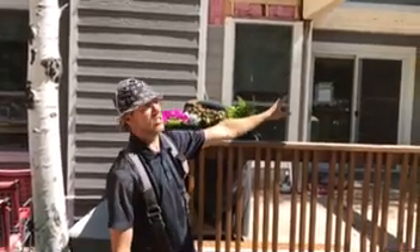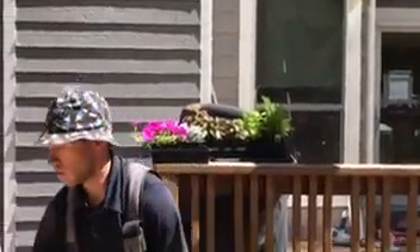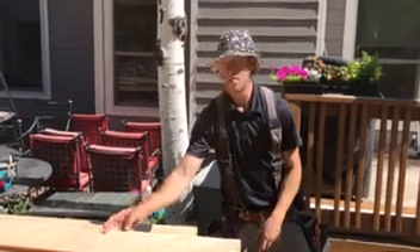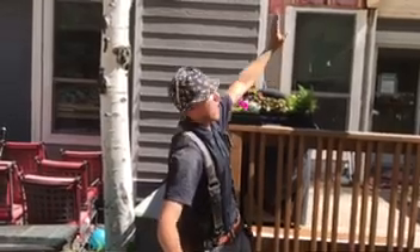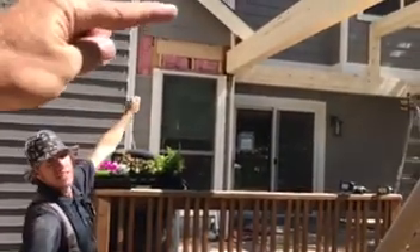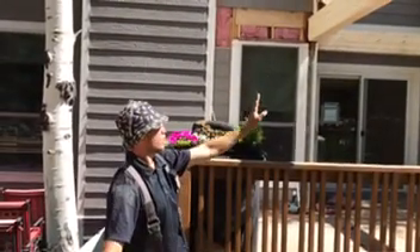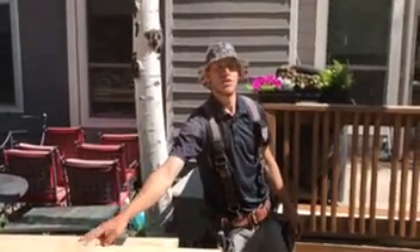In this case our rise is very simple — it's going from the top of that ridge and it's going to be resting on that beam, and right now the difference between those is 38 inches. One thing I like to do is instead of using 38 inches as my rise, I take out however much I'm going to be taking out of the rafter for my bird's mouth. When using these 2x10s for the rafters, I've been taking 7 inches out, or leaving 7 inches of wood. So I put my square up on the end of that beam and line up my tape until I hit the 7-inch mark up. That changes my rise from 38 — the true rise — to 31, which is my 38 minus my 7 inches of wood that I'm leaving on my rafter. So my rise is 31.